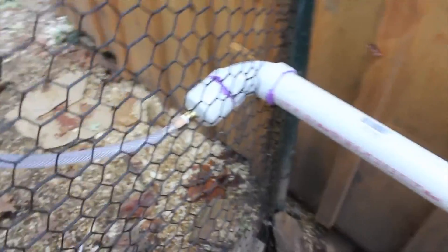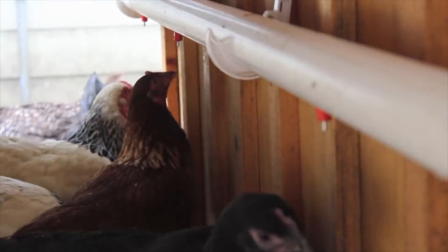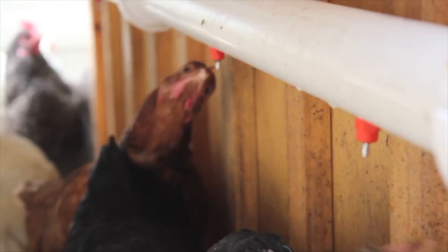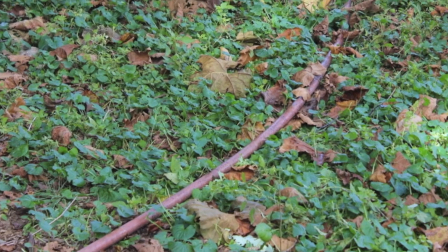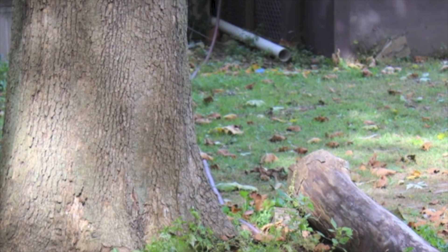Here's the inside of the coop. We have this hose with a hose barb and a fitting that transitions from the small hose into the PVC pipe. I also installed a removable cap on the end so that you can flush out the system or drain it during the winter. One bit of advice: if you're using the garden hose system, make sure the hose back to the house or barn is in the shade — you don't want your flock subjected to very high water temperatures.